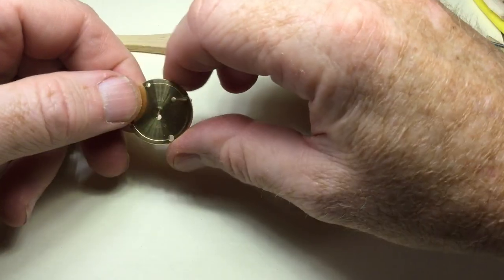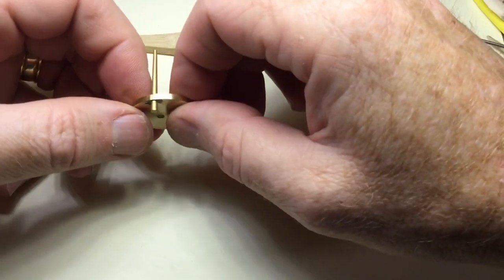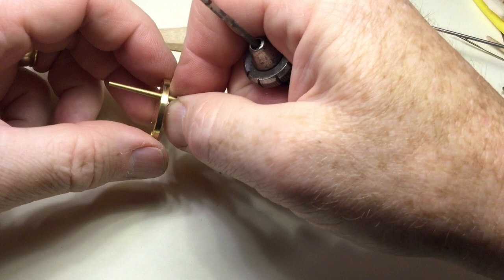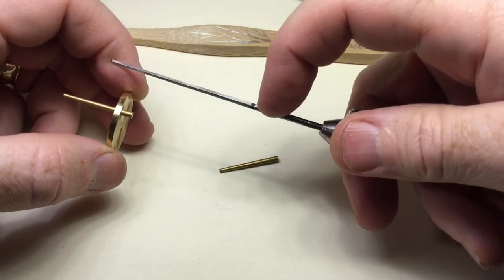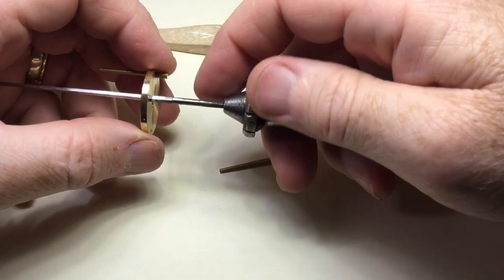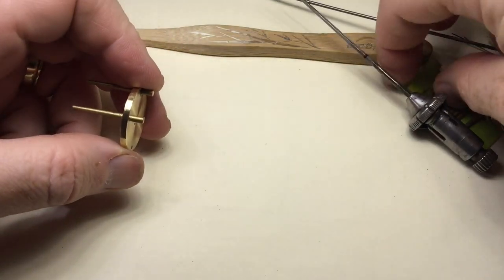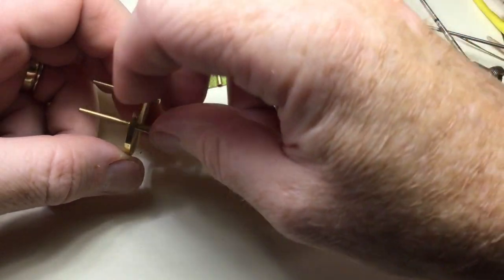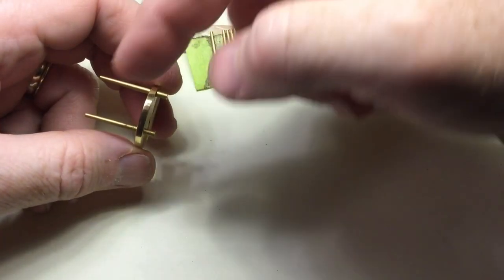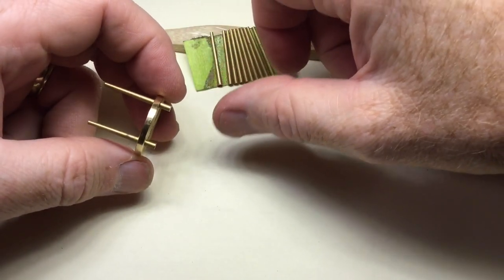This little pallet warmer has four legs and they only need to be very short — just enough to keep it off the table so the heat doesn't damage the surface. Once I got it to the height I wanted, I put a mark on the broach so I could work it to the same level with each hole. These taper pins aren't identical to each other, but that's okay — being tapered, you'll find somewhere on them that's the right size.